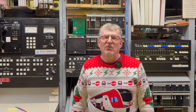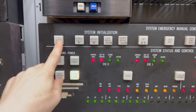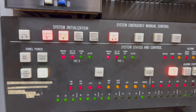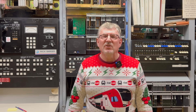The 3ESS was designed to be turned on approximately once in its lifetime, but it's old and we don't like to leave it running 24x7 anymore. So we actually do use these buttons every time we turn it on. When it wakes up from a complete power-off state, we tell the processor that it needs to do a full reload from tape. So we press enable to allow access to the keys, then stable calls, then memory reload, and finally init execute, which actually triggers the boot sequence. It now boots from a tape emulator which we made, and that could be another video if you all want to know more about it. The whole machine is pretty interesting too and deserves a full video if enough of you in the comments below say that you want to see one.